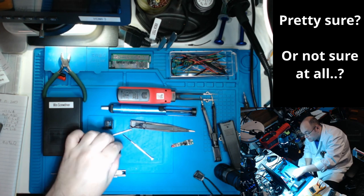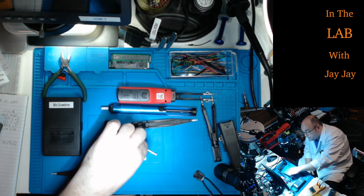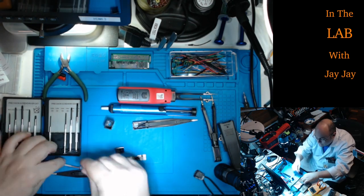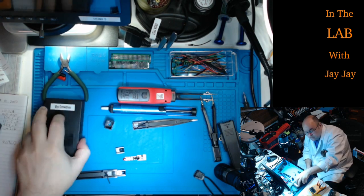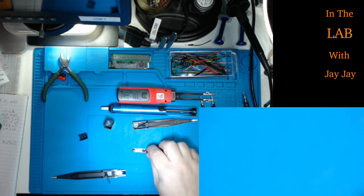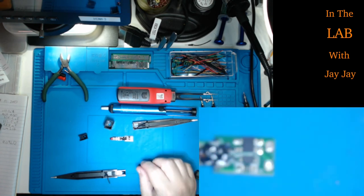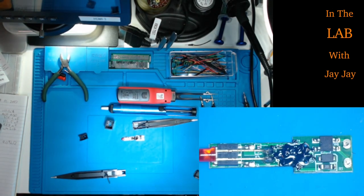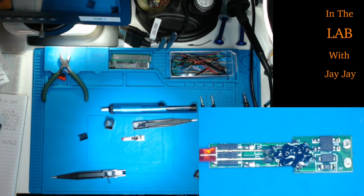Anyway, this one's broken so it's not going back together, but this is the circuit so we're in. Why don't we put it under the microscope - let's do that. Well, we've got some surface mount components. It looks like the resistor is marked 2 meg - 205. So we've got an SMD tester here, let's give it a test. It's on resistance mode and not getting a reading.